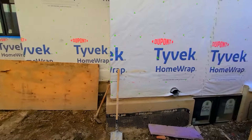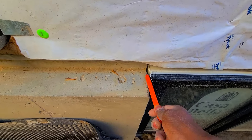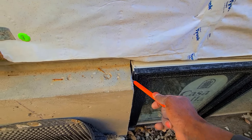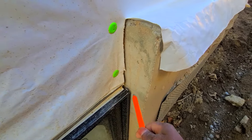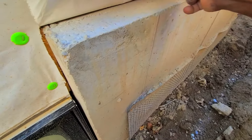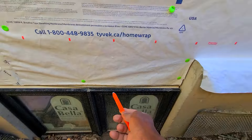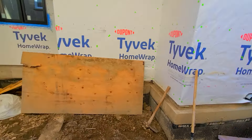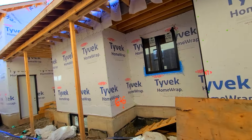This is the side section. So here we're gonna have to figure out — as you can see, the window should be lower, level with the concrete ledge or even a little lower. Over here we're gonna have to cut this concrete off and bring it down. We cut off six inches so that way we can sit the angle right onto the concrete ledge and bring our brick right over. Around this section they have a lot of step-in and step-out design.